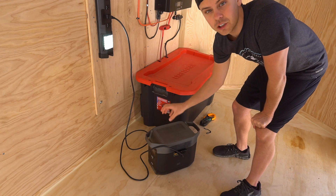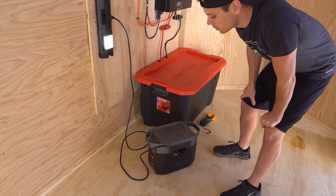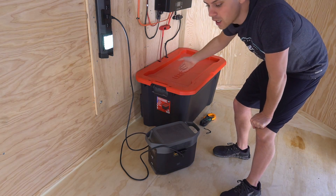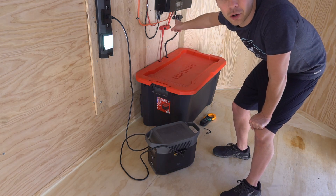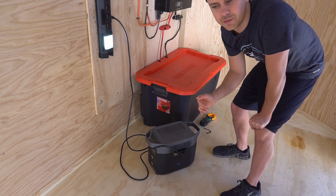I'm charging an EcoFlow Delta — I use it to power my heat gun and other tools while building the system. Right now the inverter charger is charging up the batteries and everything works flawlessly. It only took about one minute to program this new inverter — I just had to set the low voltage cutoff to 48 volts, and that was pretty much it.